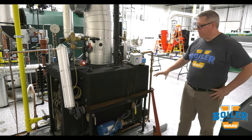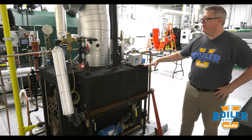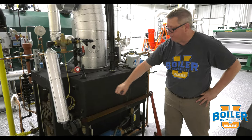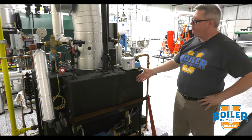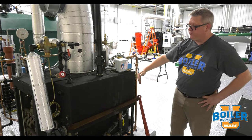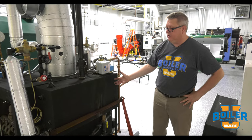On this week's boiler tip, we're going to look at this preheat tube. In a lot of cases when we've got a tank, we'll have what we call a sparge tube, which is a tube that's perforated so that steam bubbles can escape and preheat the water. On this particular unit, on this Parker, instead of having a typical sparge tube, we've actually got a fin tube, and what that's doing is radiating heat into the water — not exactly injecting it.